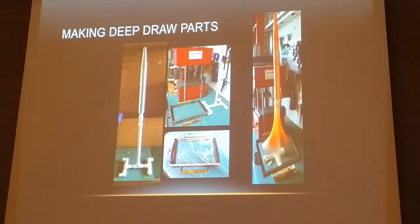You draw it quite a ways past the mandrel in order to get the part formed exactly right. When the plastic is right, as you draw it down, you can see it kind of wick right to the part, and then it will do that past the bottom — and then you know you've got it just right. If it's too cold, it doesn't pull very good. If it's too hot, it comes too fast and the walls of the part are really thin. So it's got a lot of finesse in the process. It's not an elegantly designed process yet, but eventually I want to automate some of that for more repeatable results. I've gotten to make at least big mandrels, which is about an 11 to 1 draw ratio, and I can get good parts usually five out of six attempts.